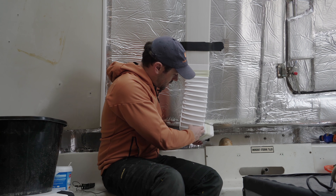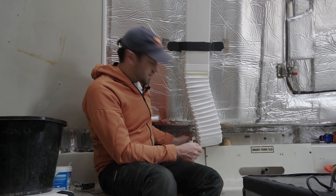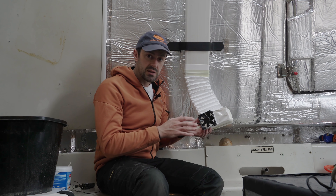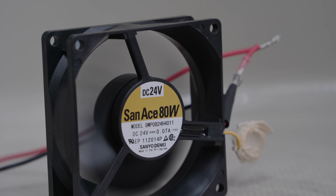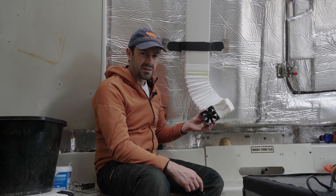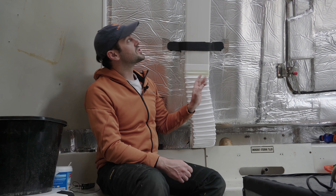Or I could move it around so it's at an angle and comes in the sidewall. But there definitely needs to be a partition to make it airtight, so the duct is only pulling air from where it should be. It also needs to be accessible because maybe the fan needs to be rewired, or there's a problem with one of them, they need to be replaced, or something gets stuck in the ducting — moisture, anything like that. Let's try to make it not too built in, because as with anything built in too deeply, getting it out again later doubles the work. Other than that, the ducting is now on this end at least pretty much done. I'm very happy about how it moves from inside to outside of the boat.